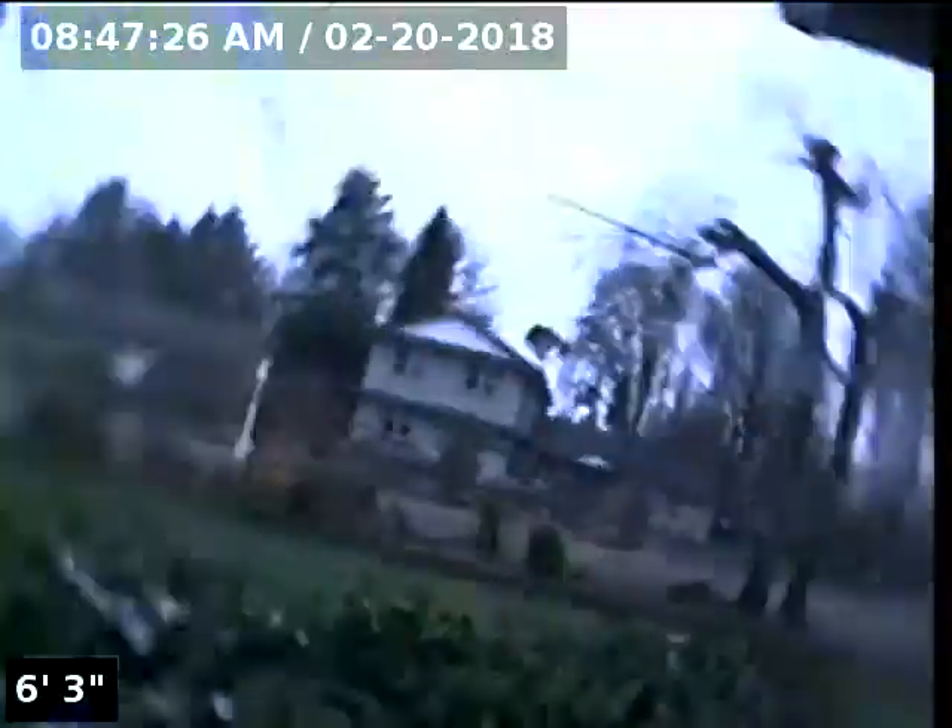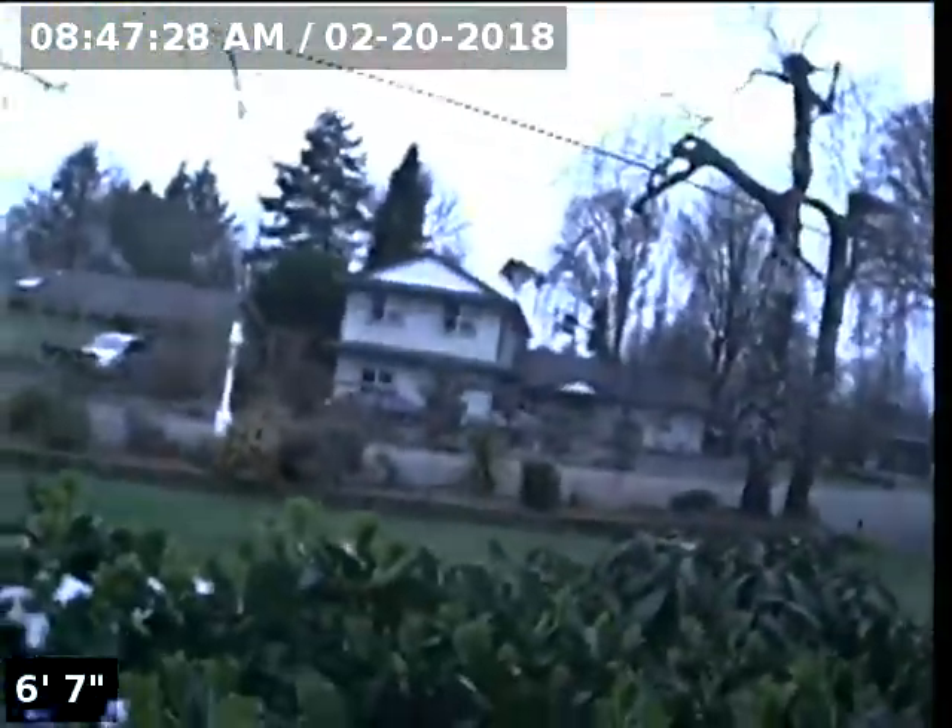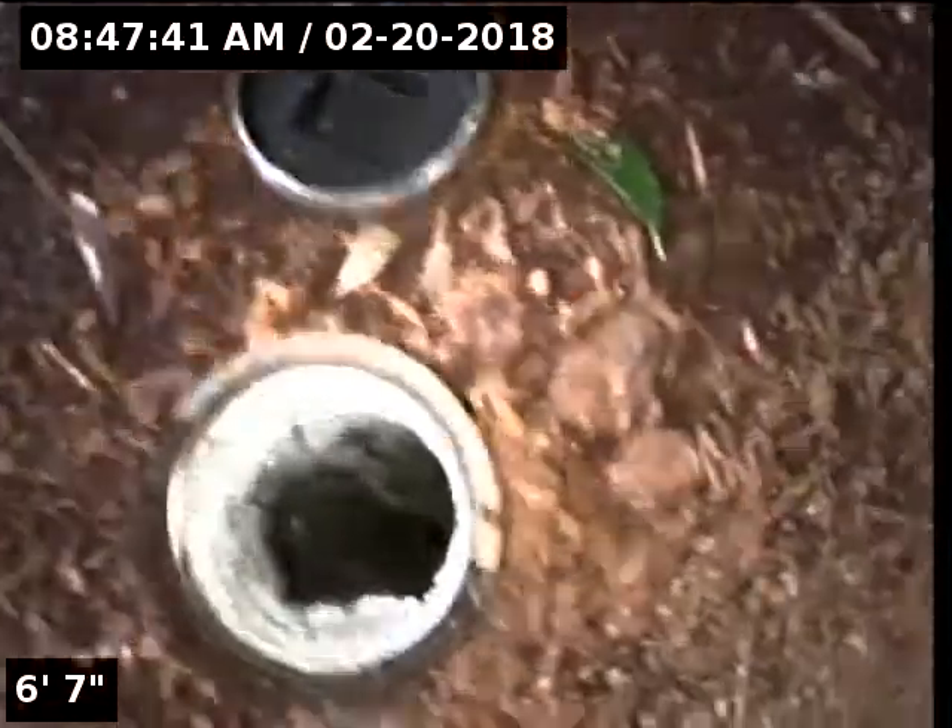The house is facing north. There's the north side where the street is, where it looks to me like it's going to exit into the city main. Here's your front entryway, and right here in the front of the house we have a three-inch ABS cleanout. This is where I'll be accessing the line for inspection today.